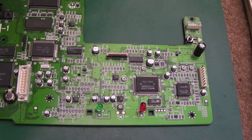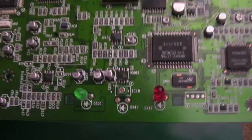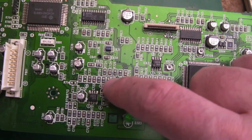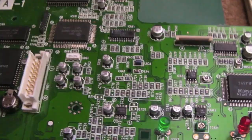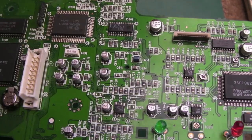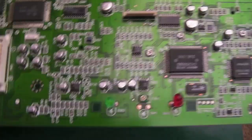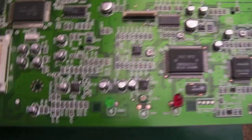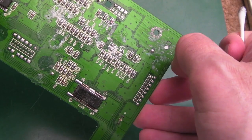You can see it's gone up a lot cleaner. I've gone over these very lightly with a fiberglass pen — cleaned off any dirt and corrosion. But on macro you get contamination — look how awful that looks. That's probably some of the original flux, some of the electrolyte, and some of the conformal coating. Up here it's still very dirty — I haven't done that part at all. I've been at this for about an hour already. And watch what happens when it leaks through the vias to the other side — it's all white and disgusting. So the underside, wherever you clean the topside, is going to need a thorough clean as well.